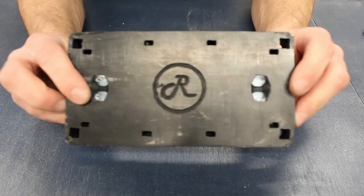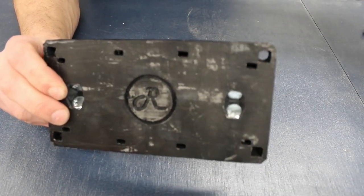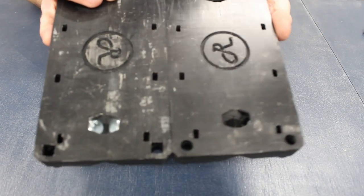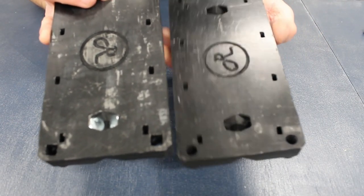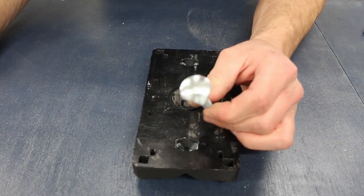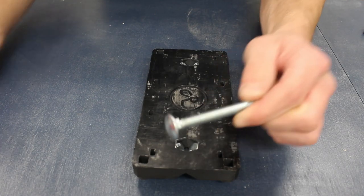The carriages come in two variants, a coach bolt variant and a standard variant. Coach bolts are used instead of standard bolts, as these do not require a tool to secure down. They have a square shank on them that fits within the 3D printed parts, so you only have to tighten the nut down to them.